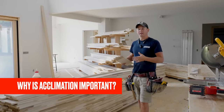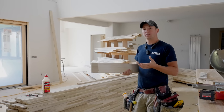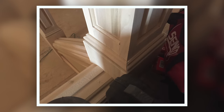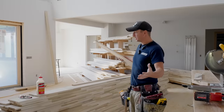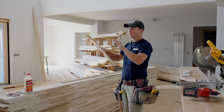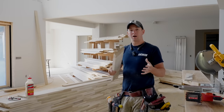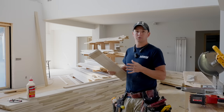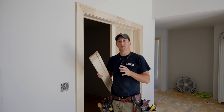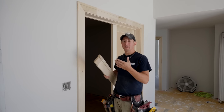If you don't condition your job site properly — at the time of shooting this video it's August and here in the Midwest we have extreme humidity swings. On that job I'm referencing, the builder did not turn the air conditioning on. As we started installing our millwork in the spring with lower humidity, the house filled up with humidity and everything started to blow apart. Even the newel posts' trim blew open — that's how bad the humidity issue was. A lot of carpenters don't mean to do shoddy work; they just don't know any better.